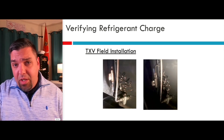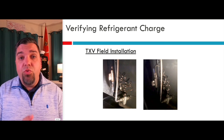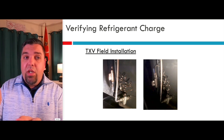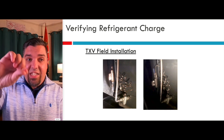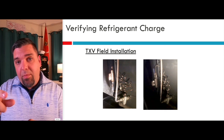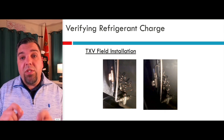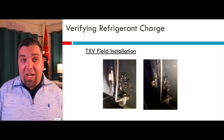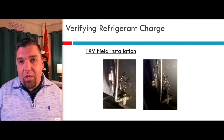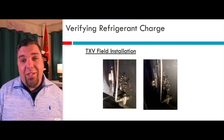This happens all the time. Make sure when you're mounting these metering devices, you look at the installation instructions. Most manufacturers do not allow you to mount the bulb like the left-hand picture — they want it on the right, with the sensing bulb capillary tube going into the top of the bulb if you're mounting it vertically. Ideally it would be on a horizontal, but most people use street 90s to keep everything tight to the coil. Make sure you're mounting it correctly and insulating it correctly afterwards — I shouldn't be able to move it during maintenance. And please, don't use that tar wrap.